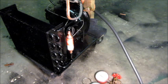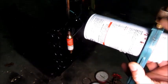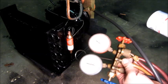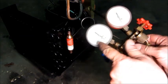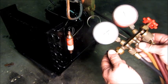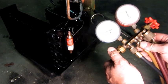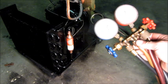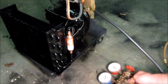Tapping a can of refrigerant - you can see it there. I'm going to hold it upright so the air space in here is hooked up to the hose, and that will let me purge any air out of the yellow hose. If there's any non-condensable gas in that can it will be gone. Now I'm just going to put some vapor in the system. That wasn't enough - needs more. I want this to stay on the positive pressure side, not in vacuum. Once the gauge is closed, that's 10 pounds - that's probably enough. That way when I disconnect the hose from the gauge port service port, I know that air won't go back in, and we'll have it as close as possible to only refrigerant once the job is done. It'll eliminate a lot of potential problems down the road.